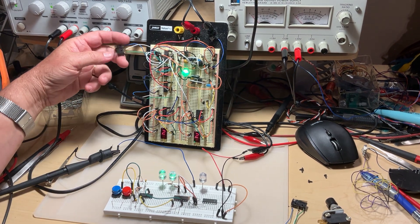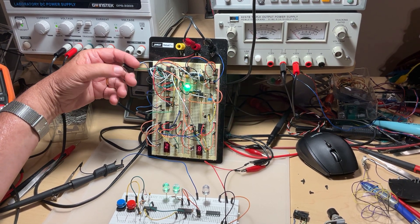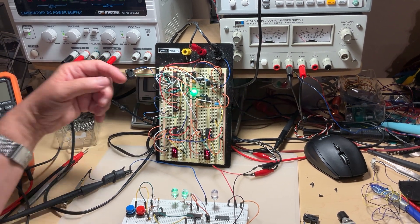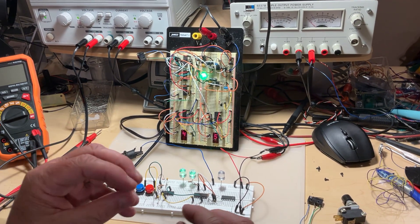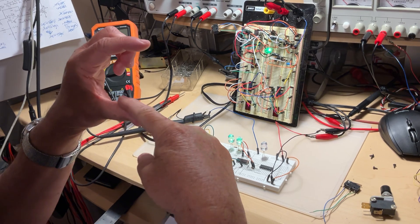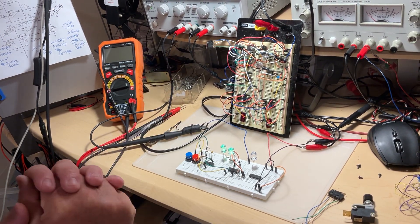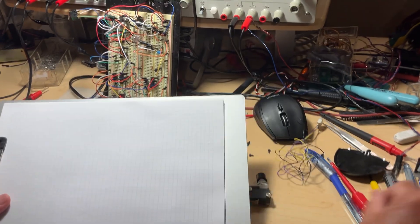For that reason you have to correct that situation — you have to do the debouncing. The one on top has this problem corrected, and it works very nicely: no matter how fast or slow you press it, it counts only once. This can be done different ways. In PLCs, they simply add about 10 milliseconds delay. Another way is to use NAND gates to build a little debouncing device, which we're going to talk about in detail later.